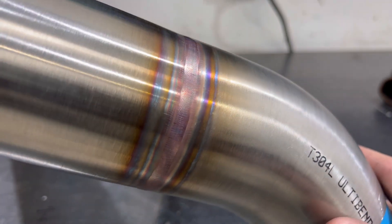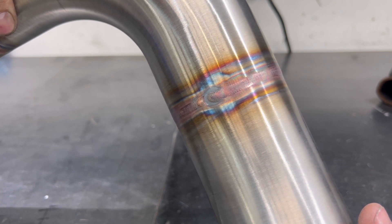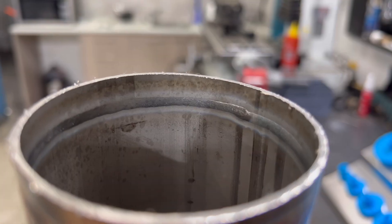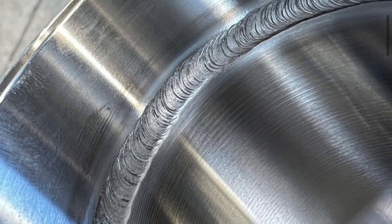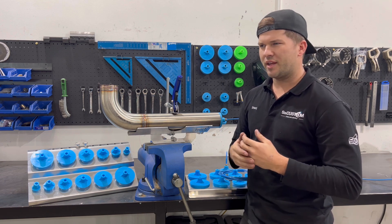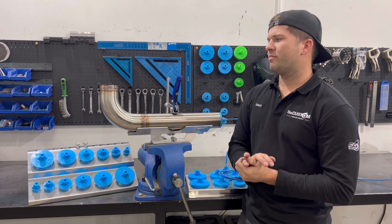You can see I've got a nice little walk around the tube, and then this little black dot at the bottom is where it oxidized when I slipped off and the torch came loose — that's what you want to try and avoid. Here we have a nice penetrated purge weld. The little splatters that look like oil are just cutting fluid from the bandsaw. You can also see the little overlap from the stop-start. In this other photo I've done the purge weld using filler wire, so you can see the root run has been pushed through a bit more, but it's nicely purged on the inside — that's the difference between a weld with no wire and a purge weld using wire.